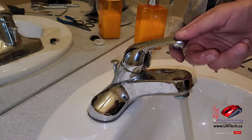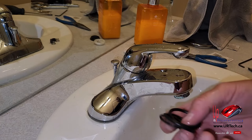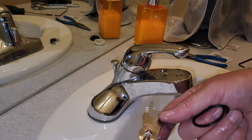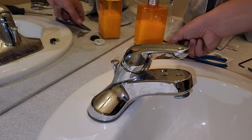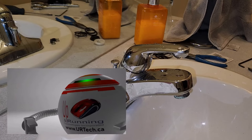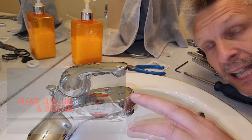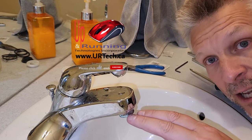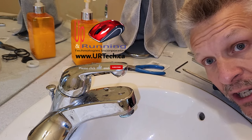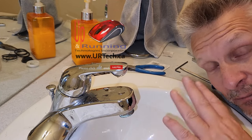Now turn the water line back off, tighten up that set screw — don't be afraid to put a little torque behind it, the threads are pretty good. That looks great. Let's turn the water back on. Hot is hot, cold is cold, mix is mix. For this type of unit, I didn't need all the other parts and certainly didn't need the cartridge remover kit — I could have just bought the $8 kit. If you found this video useful, please give us a thumbs up — super appreciated. Subscribe is also appreciated. If you have any questions, get hold of us at www.urtech.ca or leave a comment below.